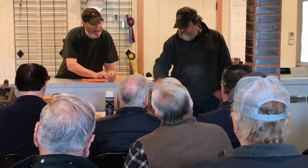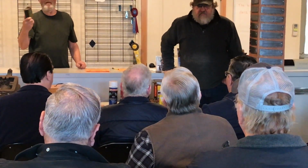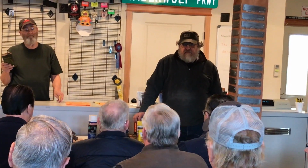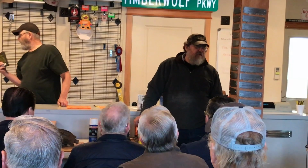You ever tried this one? ATF and acetone? I haven't. There's a 50-50 mix. I've used it a lot. Whatever container you put it in, you gotta shake it up really good to separate. And I put it in cylinders, and basically you gotta give it, you know, sometimes a month. Yeah, stuck things didn't get stuck overnight. You're not gonna unstick them overnight.